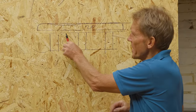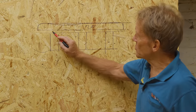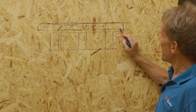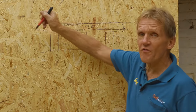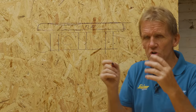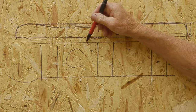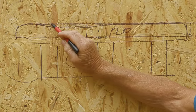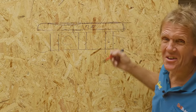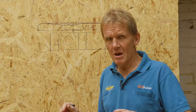Most importantly, what we put here is a vapor barrier, and that vapor barrier goes all the way along the underside of the insulation — so on top of our OSB decking. The vapor barrier has to wrap up the sides and be perfectly sealed all around. Any moisture that comes through here — airborne moisture, that's the vapor — we don't want that vapor migrating through the board, through the insulation, and sweating on the top side of that insulation, because if we do that we get rot on this piece of decking underneath the GRP. So if you're doing a warm roof, you put the vapor barrier on the warm side of the insulation.